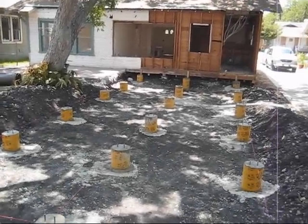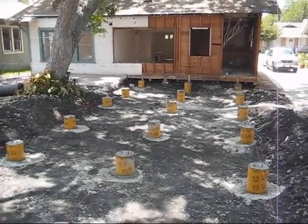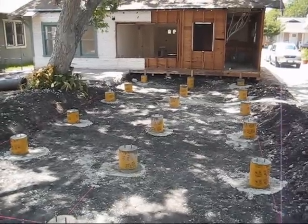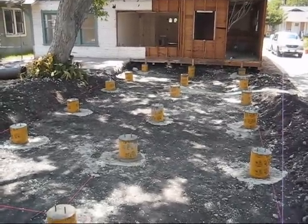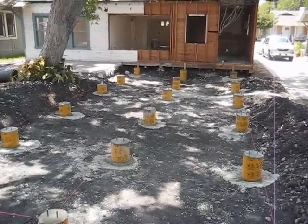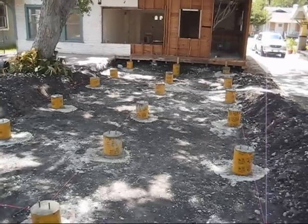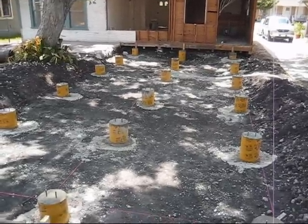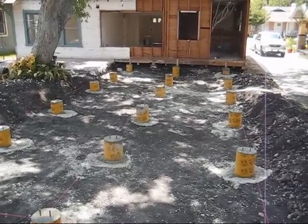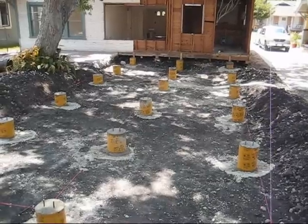Showing you an update, week two at the neighbor's house. We got our foundation done — we do our own foundations over here. TomTarrant.com brought the bobcat in and with a two-foot auger we dug 18 holes, two feet deep, filled them up with concrete with some number four rebar, then came back with our 12-inch sonotube forms and set them on top and filled those up.